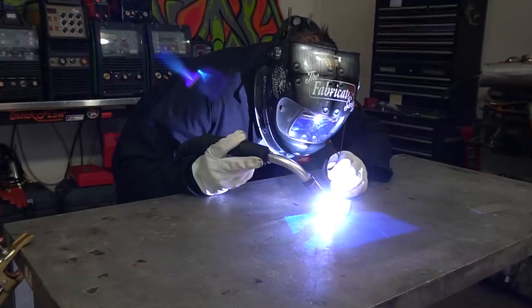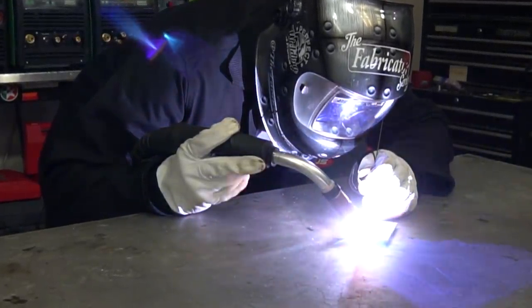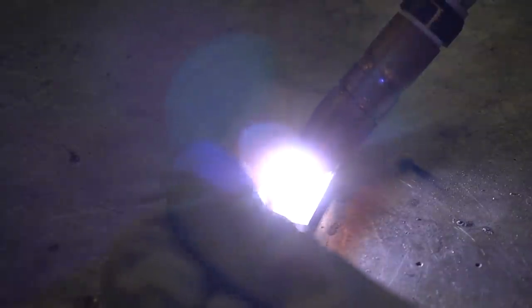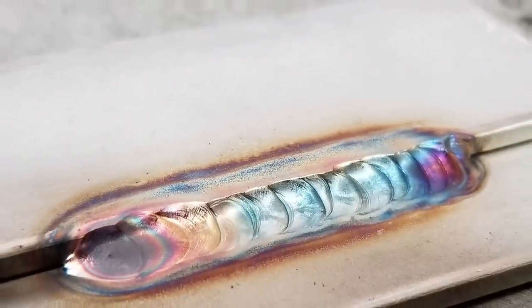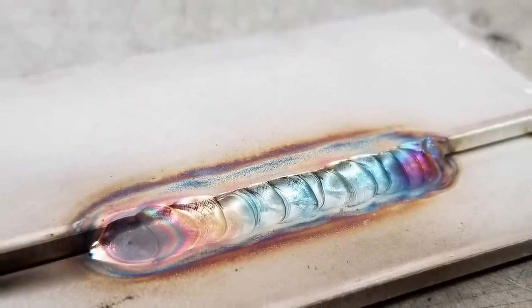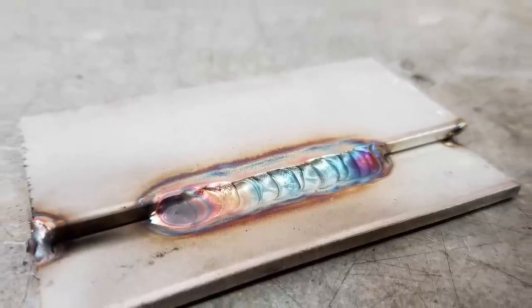You now have essentially a scratch start TIG with a MIG gun, and this is pretty much what it looks like. This is actually surprisingly difficult because it's so big and bulky. This is a fun fact — this is the very first weld that I ever laid down doing this process, and I made sure to get it on camera so you guys could seriously laugh at what it looks like. Let's get in close and have a look — the very first MIG-TIG combo weld that I've ever done on stainless steel. Definitely tricky. Got to work on that post flow and really pay attention. I'm pretty sure you guys want to know what it looks like behind the lens, and this is it — further proving that this is legitimate. It's not a bogus or BS thing.